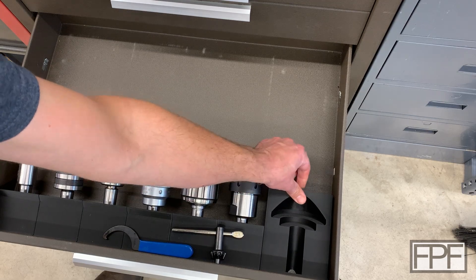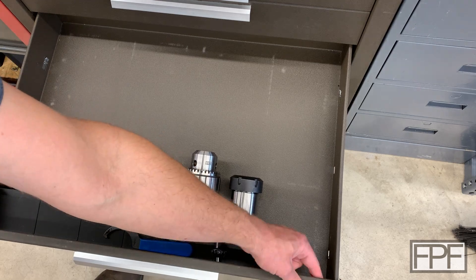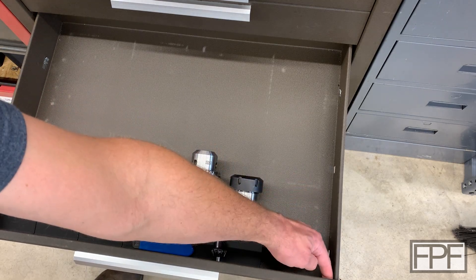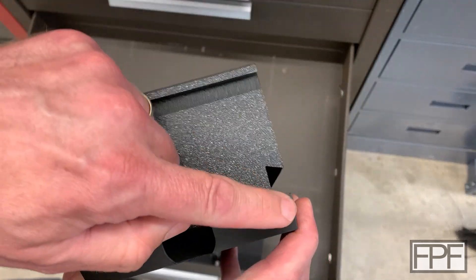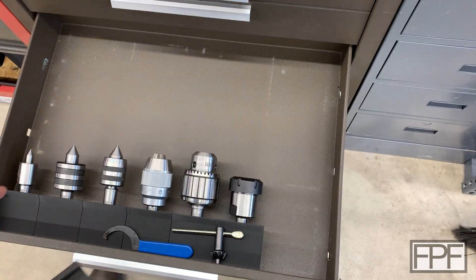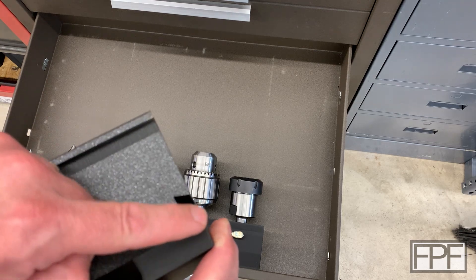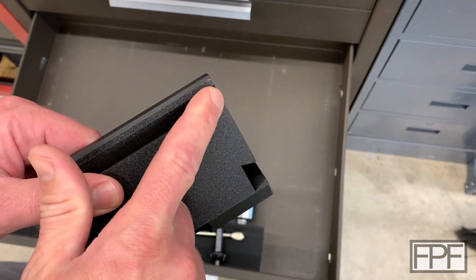Let's see how it looks in the drawer. It's like springing up — it's not going straight in. There is a piece of sheet metal from the side that comes over and I need to cut out a clearance for that. I need a small amount of clearance on this edge on the back. I actually forgot about that on this module over here too — on last week's video I ended up going across my router table to knock off this edge and I forgot about it for this one too. That's one design change we'll need to make: a relief back here for that sheet metal.